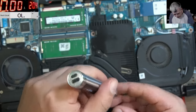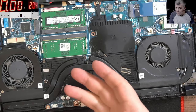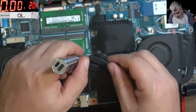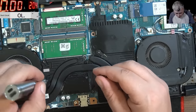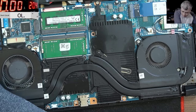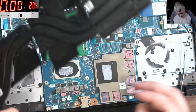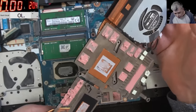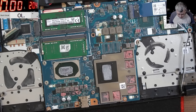This is kind of sad. I mean, I don't know. If the MOSFET disconnect the power, does it mean the CPU, the GPU is saved? Hard to say. Just based on the fact there are 2 ohms there. If it's 2 ohms on the CPU, that doesn't look good. If it's 2 ohms on the GPU, that can't be right. Huh? It's looking good. Looks like no one opened this before. That's how it looks. Good. Good.